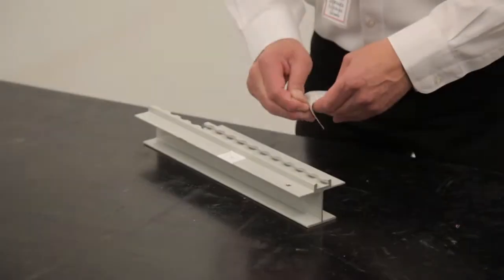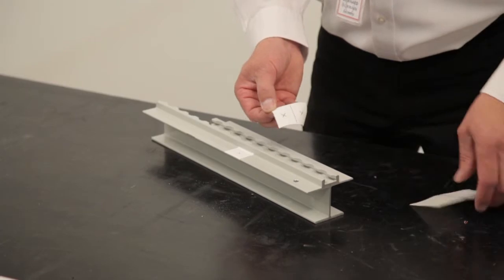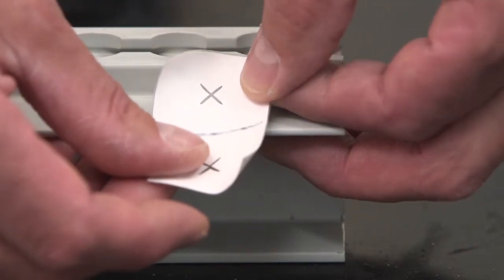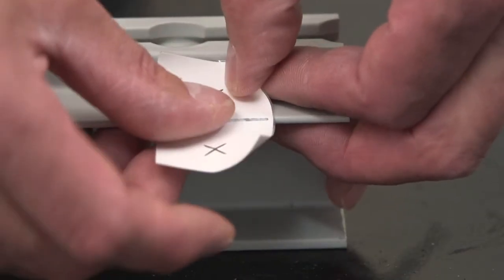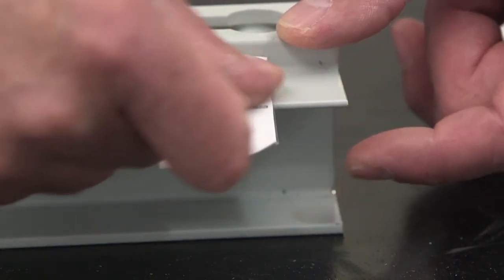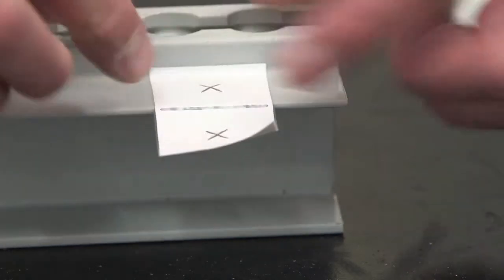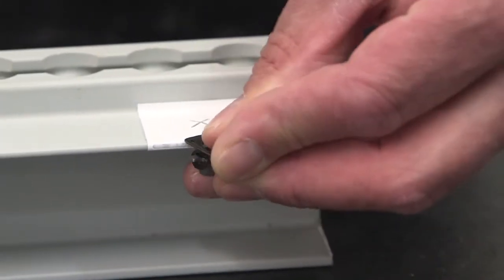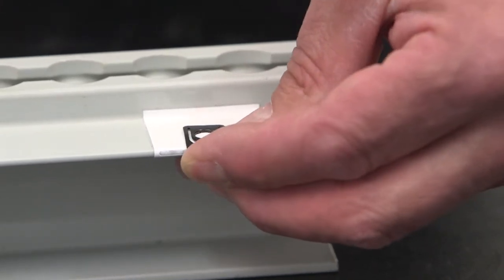Clip nut tape. The pre-compressed area should be positioned on the edge of the seat track. Position the kiss cut over the fastener hole. Press firmly. SKYFLEX provides a barrier between the clip nut and the seat track.